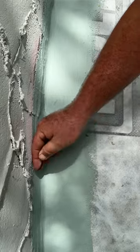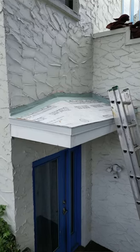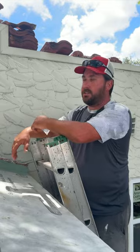It's green now and it'll have to get painted. We installed the hydrostop yesterday and gave it a full day to cure so it's nice and hard — we're not setting new material into a wet surface, don't want to compromise it in any way. Now it's nice and dry, it's watertight — that's a lifelong seal right there.